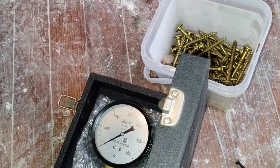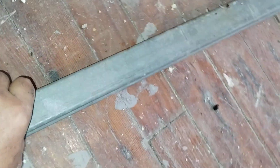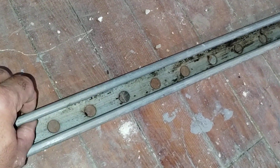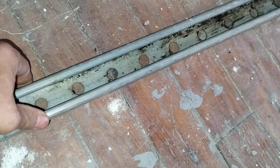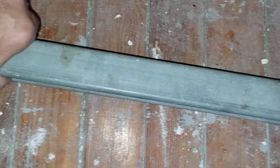Let me show you this. If we put this on the underside of the joist it becomes like a bridge from one side to the next. This is a unistrut – heavy-duty, used for clamping things to walls. It's got a little channel with a turned-out edge on each side that makes it more rigid. The bolts are about a half inch – a little greater, about nine-sixteenths.